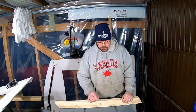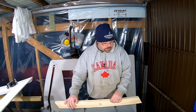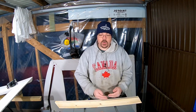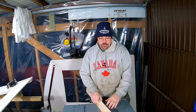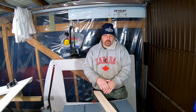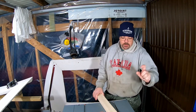What I'm going to do next is use a router to get these edges a little bit closer together and round them off. And after that I'm going to cut the board in half. The two halves I'm going to open up and use the router on the inside to build a channel through.